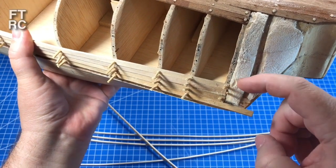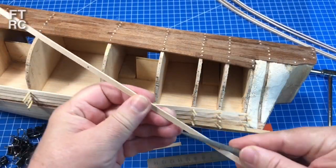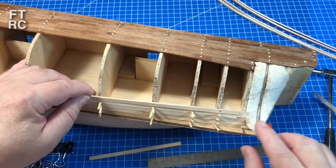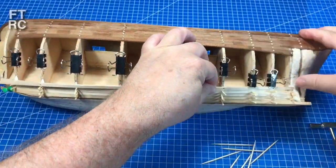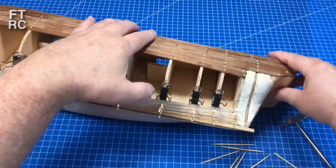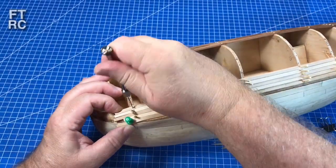Moving a couple more planks along I needed another wedge, and then I found that was the only wedge I needed — after that all the planks sat nicely right up to that middle one, which is totally unstressed and simply curved to the hull. I need to put in plank five, bevel those edges and tidy it up. Once beveled and I'm happy it's a clean plank, I dry fit it, test it's smooth and fitting fine, then it's on with the glue — only on the ribs. I drill the holes and put in my little toothpick spikes, working my way along to the front.